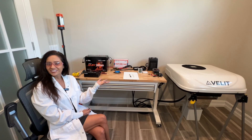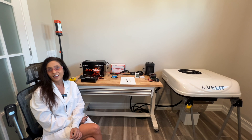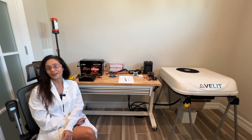Through the magic of video, the results are in. First, let's look at the battery results, which are impressive. The LiTime battery advertises 320 amp hours and we achieved 335.5 amp hours, which is 104.7% of its advertised capacity. LiTime also advertises 4,096 watt hours and we achieved 4,319 watt hours, which is 105.4% of its advertised capacity. At the $699 advertised price, this equates to only 16 cents per watt hour. So yes, you do get what you paid for — and much more.